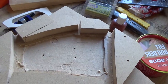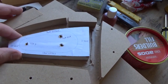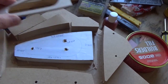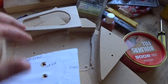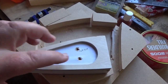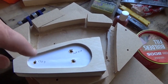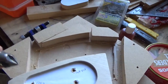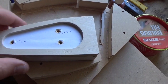You can see the screw holes in the base there — I screwed this in onto the base to keep it still, which meant I could do all measurements and make sure I had enough space around it. When it came to the actual ply, I put screws through the back so they're protruding slightly. Then I'd get the ply, press it on top, and that would give me indentations which I could then use for drilling through, enabling me to screw from the top. The screws needed to be rebated — countersunk — so there are no screw tops on top of the ply.